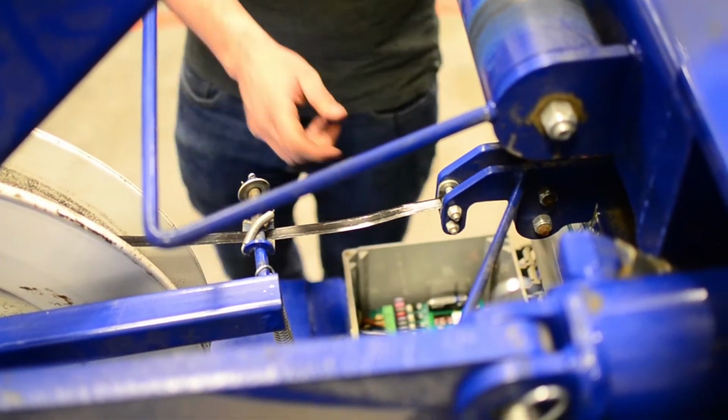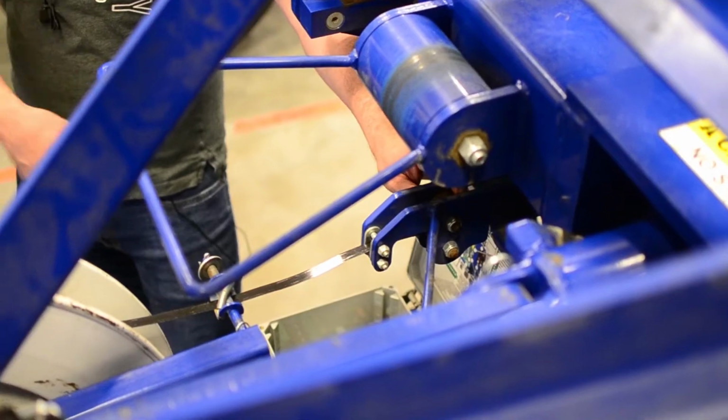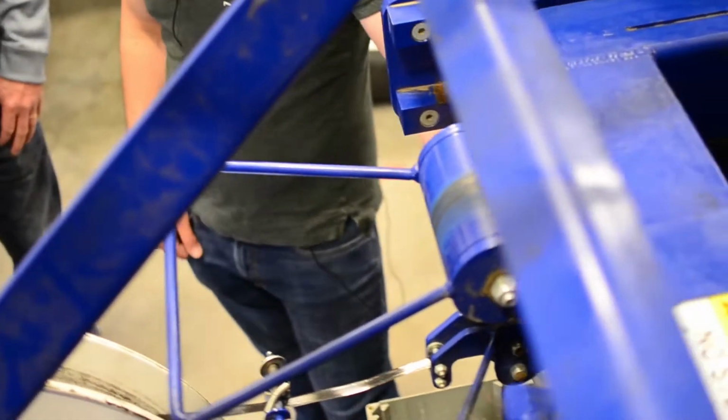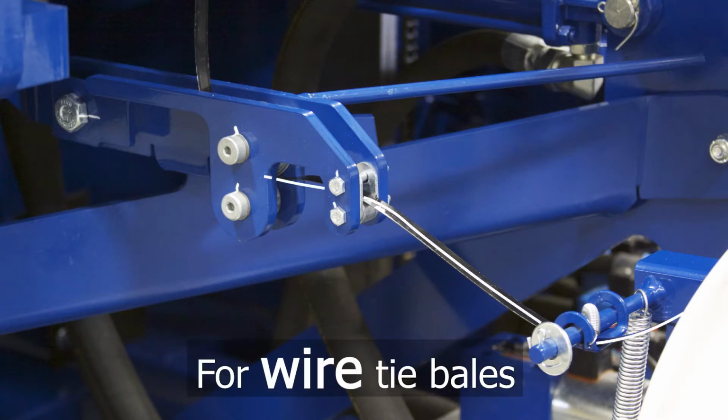So we want to make sure we go underneath the 3/8 rod, through the rollers, and through the crimper rollers. Now here's where you would be different since you're wire. You can take these crimper rollers out and just stick the bolts back in. There's some machine washers with it. Just throw them in a Ziploc baggie if you ever decide to change it or sell the machine. We'll run this strapping, if we take the crimper rollers out, around the back roller. See this back roller right here?